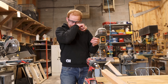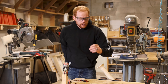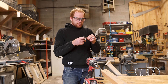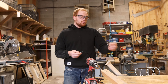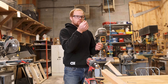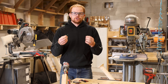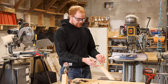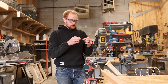If you're taking a deck screw, for example, it's most likely going to be a red Robertson or number two square, depending on what continent you're in. Or if you're taking a drywall screw, it's going to be a number two Phillips — or star if you want. The first thing you want to do is make sure you have the right bit. If you take a green Robertson or number one and put it in a deck screw, it will turn but it's going to be a lot easier to strip out because it's too small a square.